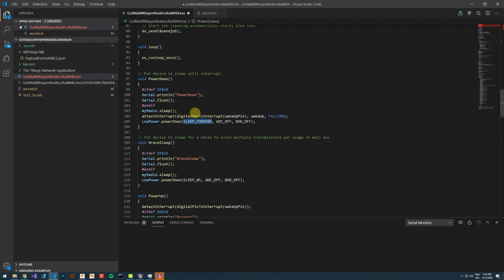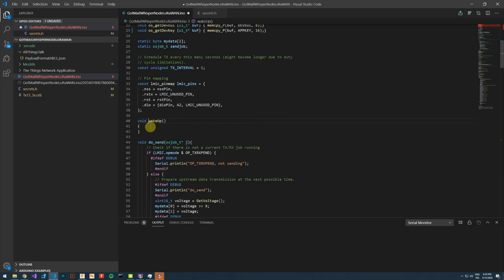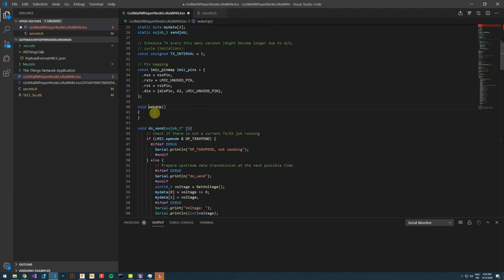So when the lid triggers the switch, this method is called. It does nothing, and it shouldn't do a lot of work. It can set some states that you can read later, but it shouldn't hold up the microcontroller, because if you have several interrupts registered, and this is running some long-running code, it will not notice the other interrupts.